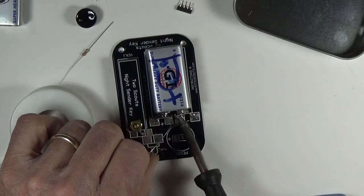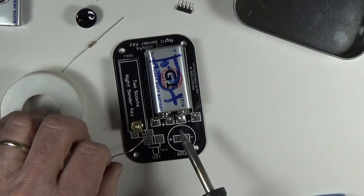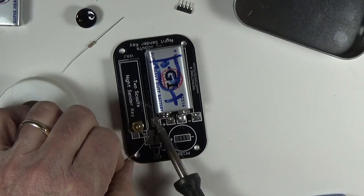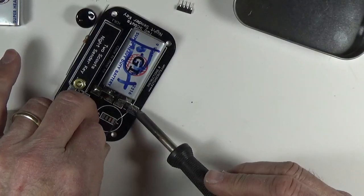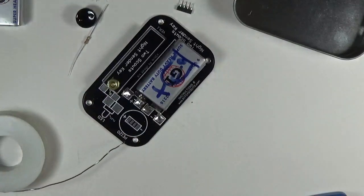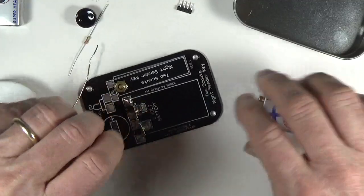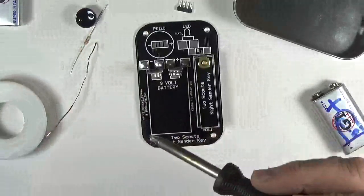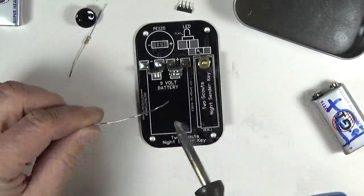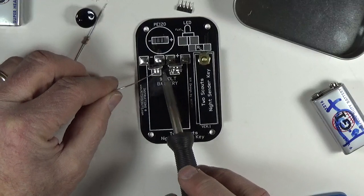This is like welding, only at a lower temperature with a softer metal. I'm going to pour in the solder to make sure I've got plenty of mechanical connection between the pad and the tab. Blow on it a little to let it cool. I like to put my fingers on these and hold them when changing the battery, just to keep the stress off the tabs. Pull that off, get the iron out, clean the tip again, add a little bit on the end, and go in and do the front pads.